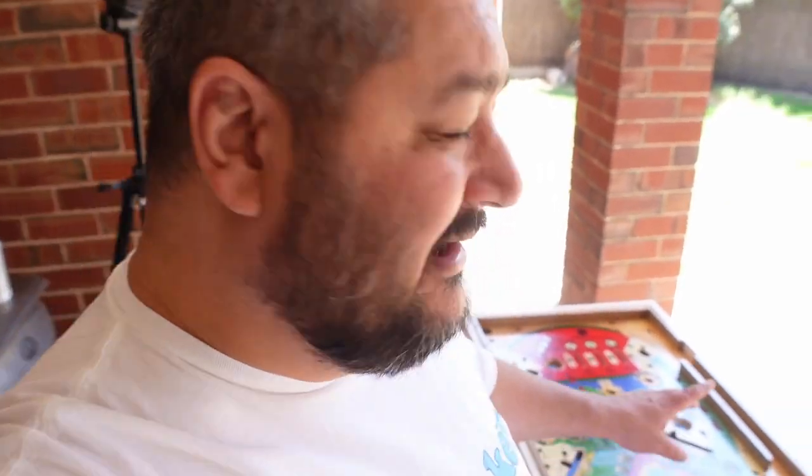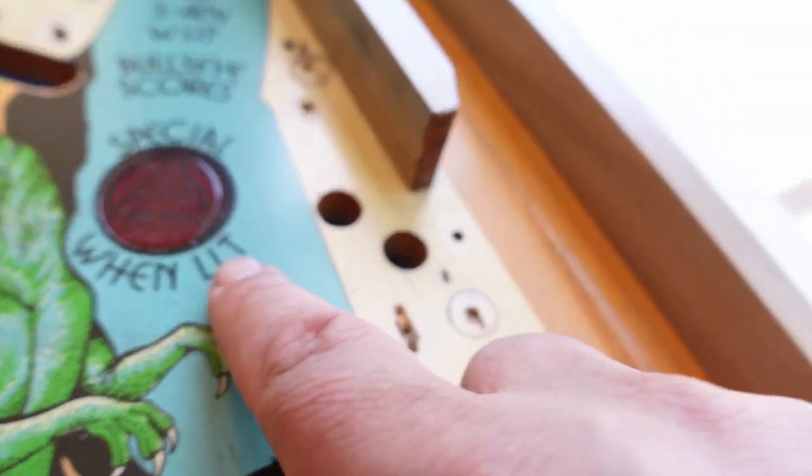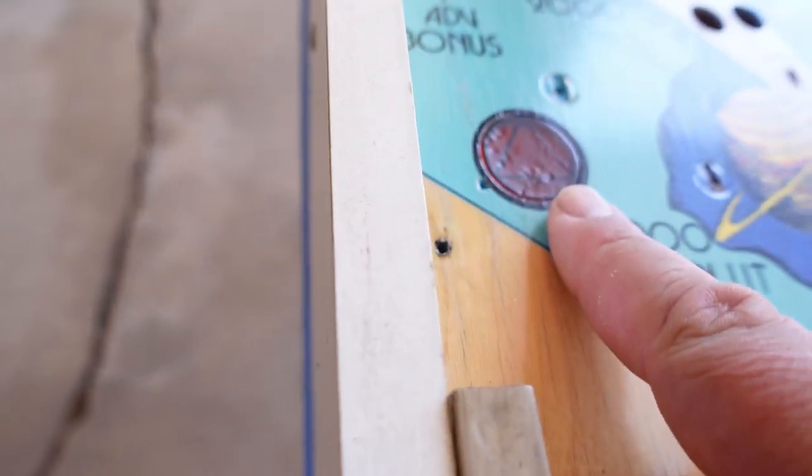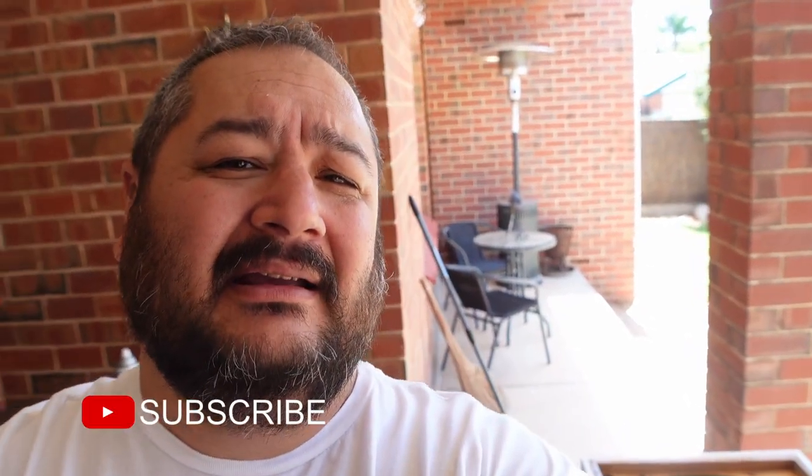What probably is my fault is on a couple of the inserts — up here on the 'special when lit' light and down at the '30,000 when lit' light — both of those are just plastic and they dimpled as well, even though I cleaned them over and over. I've got to figure out how to address that. It probably won't affect ball travel, so it depends on how good it looks once it's back in the table. I may pull those inserts back out, give them a slight sand and a clear coat on their own, then re-glue them — that should take them back to looking nice and flat.